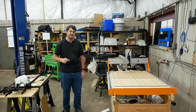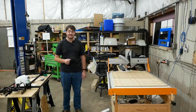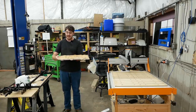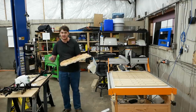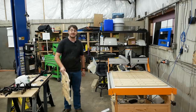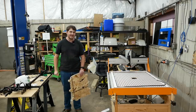One tiny annoyance you encounter when working with any CNC router is clamping solutions — figuring out how to clamp down whatever piece you're working on. For instance, I need to surface this piece, which means a surfacing bit is going to pass over every square inch of the face. So how do I clamp it down? I can't use a normal T-track clamp because the surfacing bit will eat it. Thankfully, Stepcraft sent with this machine an accessory that will help out in exactly this sort of situation: a vacuum clamping table.